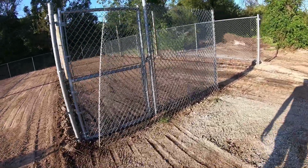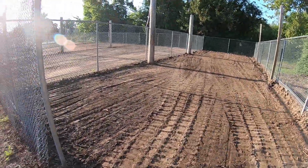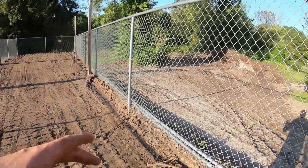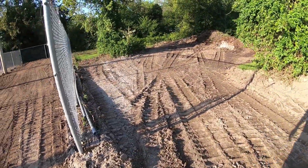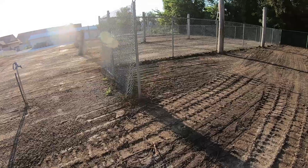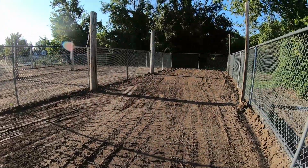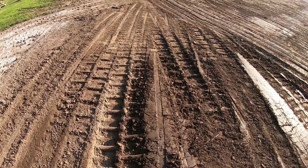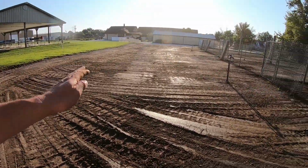My plan after I left last night, I talked to him about taking out this section of fence down through here and burying a French drain, because I was worried about collecting what water runs out here. But I guess that didn't really fly with everybody, or the budget maybe. Which is fine. I understand they're running on limited funds, and it's just a dog run. They just asked me to do the best that I can trying to build this grade up and slope it out here. There's not hardly anything you can do with that. You just track over it and it just pumps. But I try to cut as much as I can.